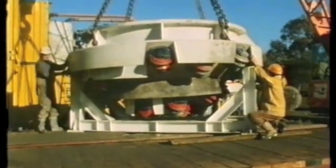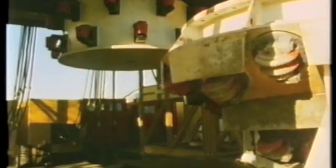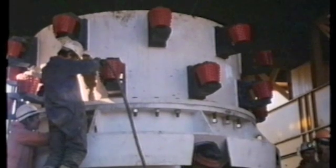At Betus, once the crown block was in place, the bottom hole equipment was quickly assembled through the open side of the mast. The assembly was to be completed with the attachment of the drilling bit — a conical centre pickup bit 3.75 metres in diameter. The bit had arrived on site and was put on the trolley to be slid under the close-coupled stabiliser. Dowels set in the flange are the means of accurate location. Flange diameter was three metres. Secure bolting is essential and was carried out with an air-operated impact tool with final tightening using a purpose-built torque wrench.